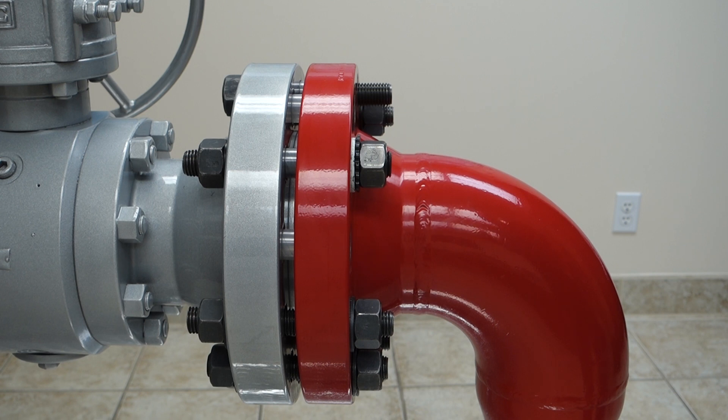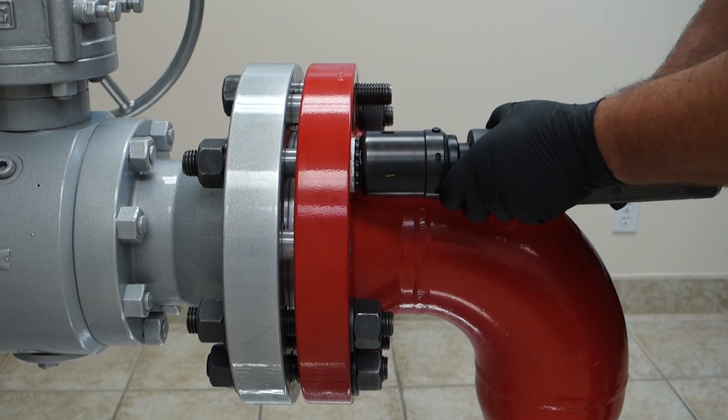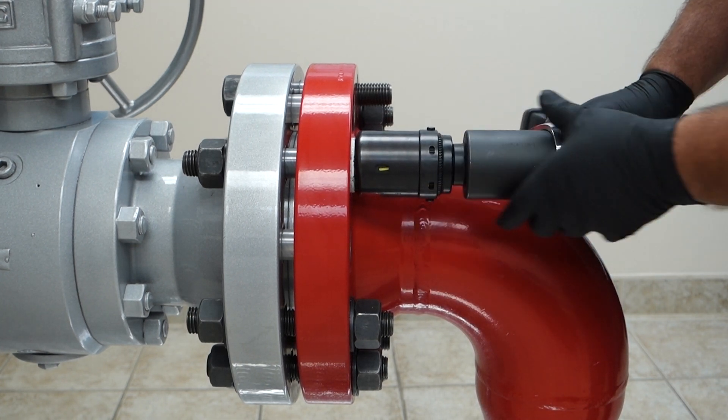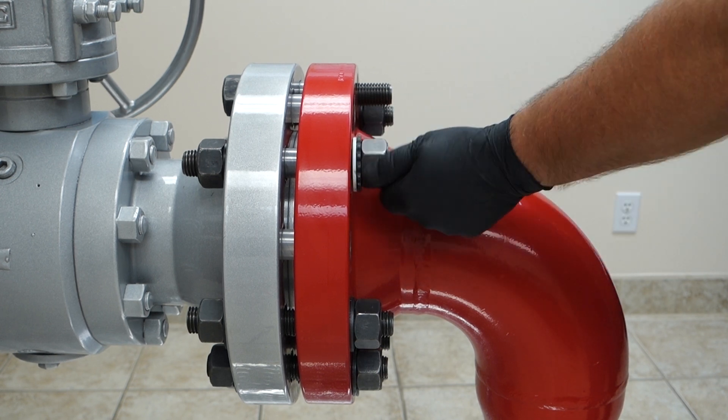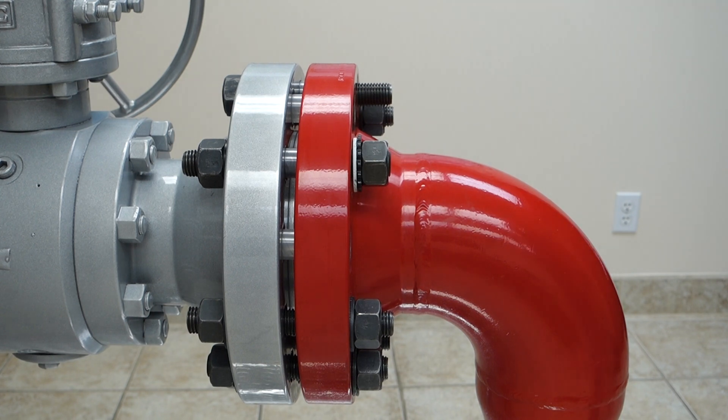Will procedures allow us to bypass or get rid of the galvanized washer? That's not my call, but the high torque washer on top of the insulator is a fantastic solution. So either way you want to look at it — with the complete insulating kit or without the galvanized washer — the high torque washer is a fantastic solution for insulating kits.